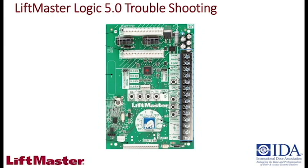So you have what we call the motor phase jumper, change it from 3-phase to single phase. It's actually the same board. This is a true 24-volt board, so it takes 24 volts AC. And when that power comes in, of course, the LEDs will light up to let you know. If you ever walk up on a unit and it does not have lights on it, you know that you don't have 24 volts going to it, right?